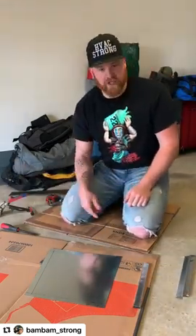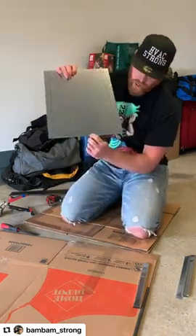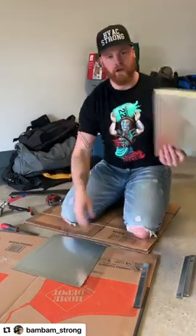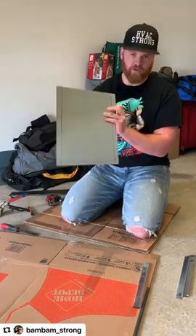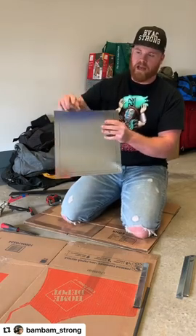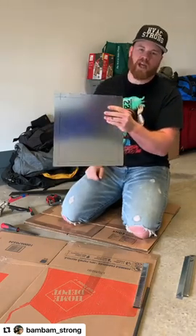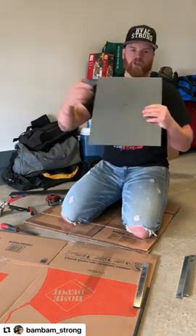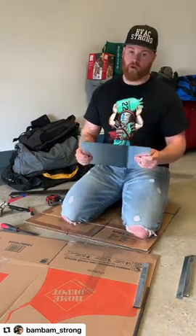What we're going to do now — I've marked out the front here. I put a half-inch mark and a one-inch mark on the bottom and put them across. That's our flange on the bottom. I've got my one-inch marks on the sides for our fold-overs for the cleat to hook onto. Then I've got an extra three-quarters on the top so that when you put the cleat onto the existing ductwork, you can hook that into the cleat, once again creating a nice airtight join.